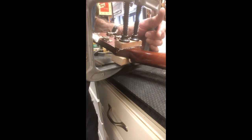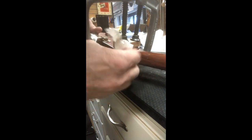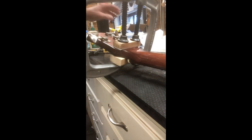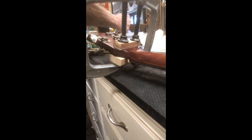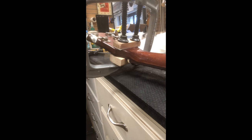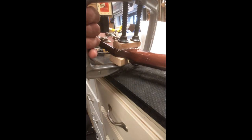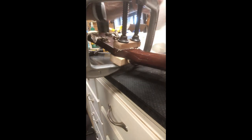The other thing with cleaning up glue squeeze out is you don't want to completely remove all of it. The last time you get glue squeeze out, you're going to want to leave some, because as it dries it's going to suck back into the crack and you don't want a glue-starved joint. A good tight glue line is important — you want wood to wood, not gaps. Now I've got my clean rag and paper towels ready, applying clamping pressure, and there comes the squeeze out. One more time with the dry paper towel, saving my wet rag for the very end.